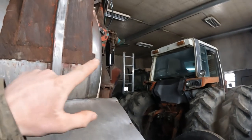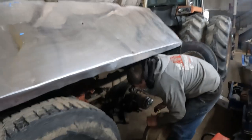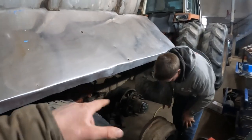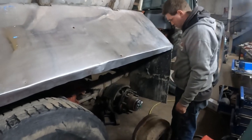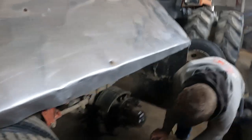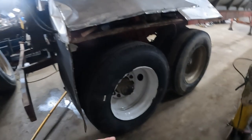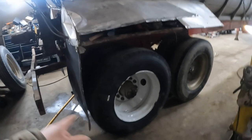The back end is done and functioning. We're also changing four tires on the tanker — this side needed new bearings and new seals because the seals went out. Christoph was checking oil and that one was dry; the bearing stunk like they were going to blow, they wouldn't have lasted the first day. We put two new rims on because they just kept going flat — new rims, new valve stems, new tires.